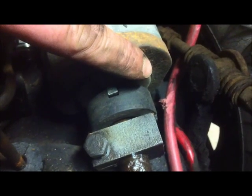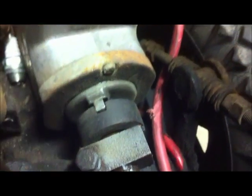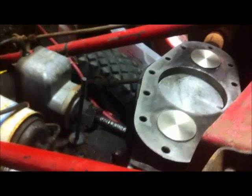That's when it should spark and at that point the motor should run. On the magneto itself, in this area, there's actually a mark on one side of the impulse coupling and not on the other. When that mark lines up with this area, that's when it should spark. Somebody must have taken my magneto apart at one point because the mark is 180 degrees off from where it should be, so when the unmarked side is hitting the timing mark, that's when mine is making the spark. Make sure you assemble it properly.